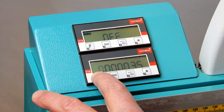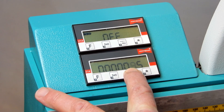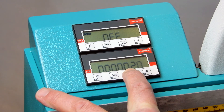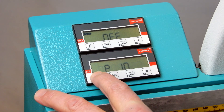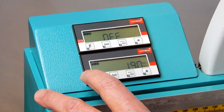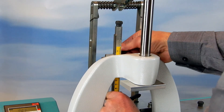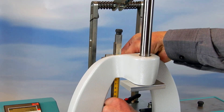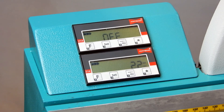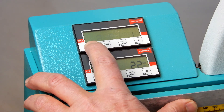P9 — then you choose the digit and you set the desired digit. Press F again and hold it until the unit goes back in its normal mode. By pressing F and Z together, you set the reference point. The same procedure applies for setting the keyway routing height.